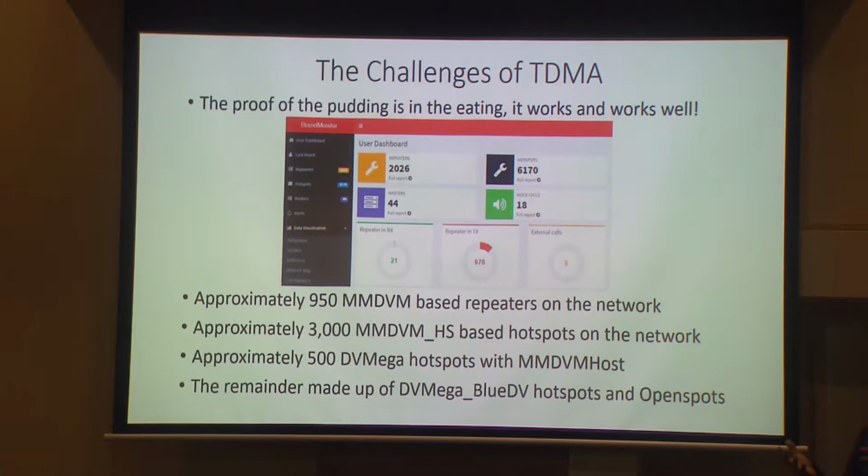I can just use talk group 9. I go in on the repeater, back out on the repeater. I don't hit the network. I just stay local. Or I can go statewide. Here in Queensland, I'm on Brandmeister, 5054, Queensland wide. New South Wales, 5052, ACT, 5051, etc. Or Australia wide, 505. That's every Brandmeister repeater in Australia.